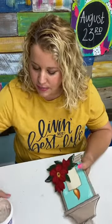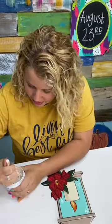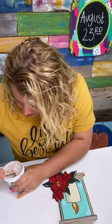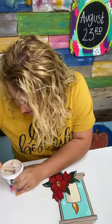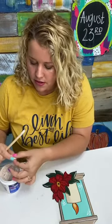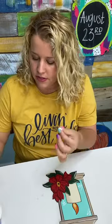This is quarter inch revolution plywood from Lowe's — that's what I cut this out of. I was checking out my spackle here because I told you guys I was going to use this, and now that I'm opening it up, I'm looking and it's kind of dry at the top. So I'm going to dig up some fresh spackle from the bottom. It still feels pliable like putty, though. I'm going to dip just a tiny bit out because it's not going to take much at all to fill this hole.